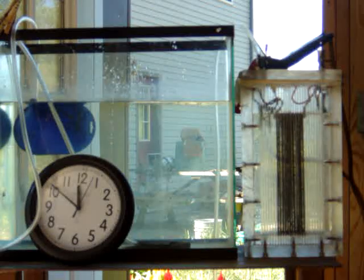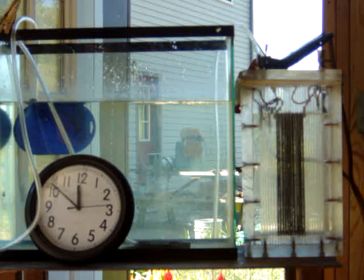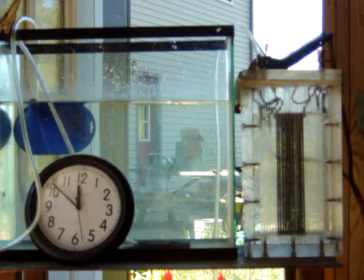What you're looking at here is a 12-plate setup running at 24 volts. I have one positive, one negative, and 10 neutrals, so that each plate is only receiving right around 2 volts. I'm running a KOH distilled water solution of 2 teaspoons of KOH to 1 gallon distilled water.